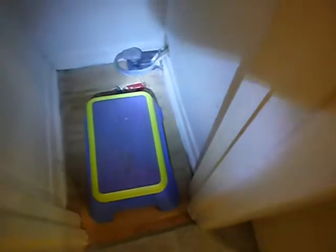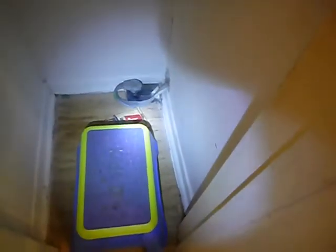But what do we have under here? Look at there. Gas valve not in use, should be capped off. Now the good thing is maybe you can get a gas range in here. I doubt it, but maybe. And then we have the electric power supply cord coming in here. Check that out. See that? It comes through the wall. And then the receptacle is face up, so if you spill anything, it just goes right into that.